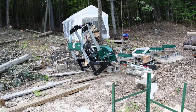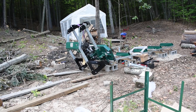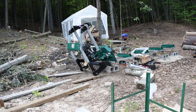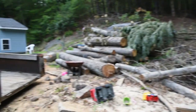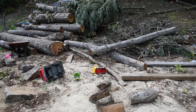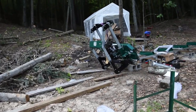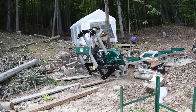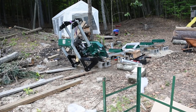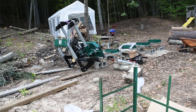All right, here we go. So I didn't record, apparently, because my camera was off and I didn't know it, but I didn't record how I got the mill to this point. What I did, as you can see that purple strap up on the top up there, I tied that to the frame of the mill and had my winch on my trailer. And you can see the winch line going under that log. I'm using a chain over there on the log, just kind of like a fulcrum or pulley or whatever, but then I ran that to there so I could tip it back. And then I pulled it forward from underneath by hand, and as I pulled it forward underneath, it tipped back further, putting those feet up high enough for me to rest them onto the rails. Now they're sitting on the rails. I'm just gonna get up behind it and push it on, hopefully, because this thing is heavy.